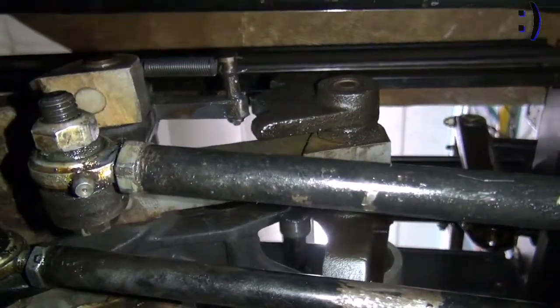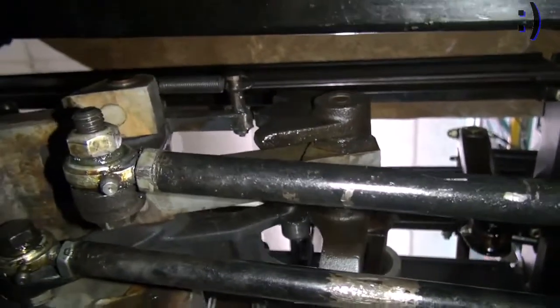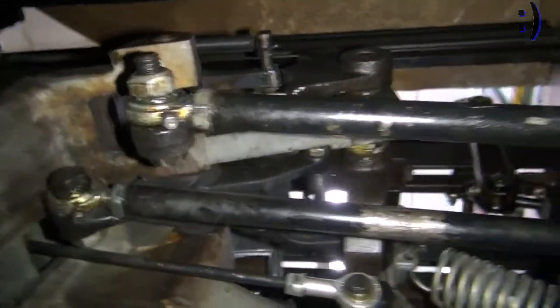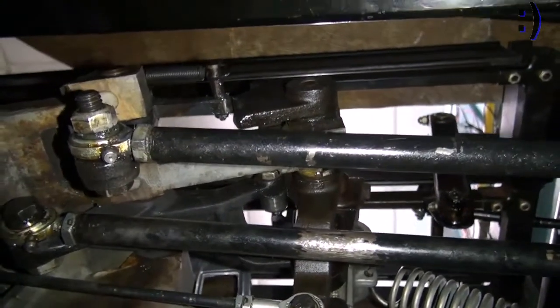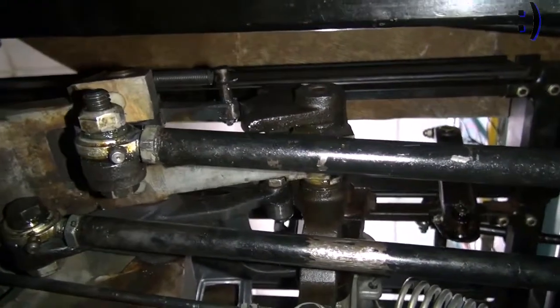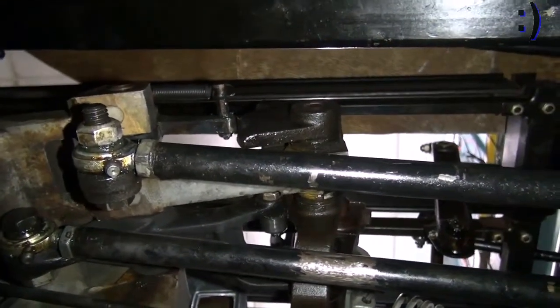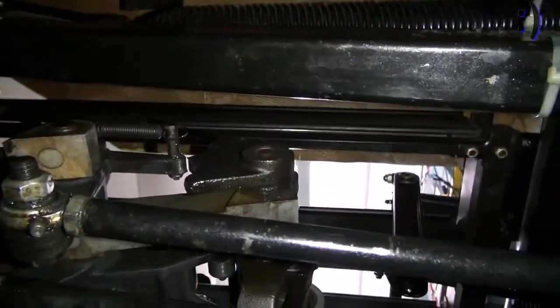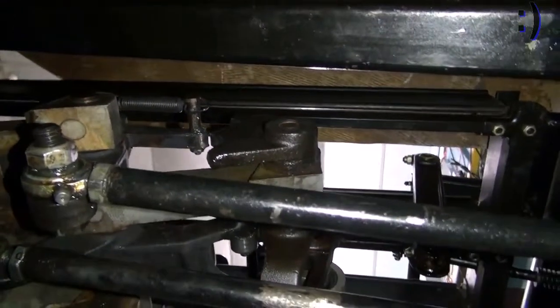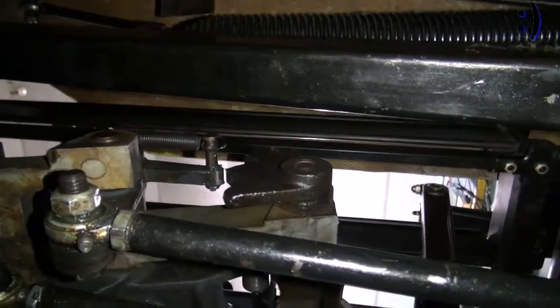That's probably about 1/8 of an inch. If it's too far away, you need to make the respot rod longer. If it's too far away, you may not have enough drive to close or open the cells. If it's touching here, you need to make the respot rod shorter. If it's touching here, it may not shift or flip when the table goes up to go back down and open the cells. So once that is set, you can do the next step.